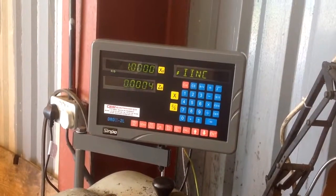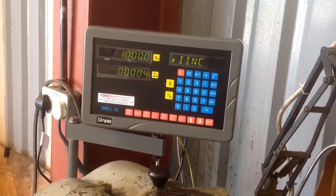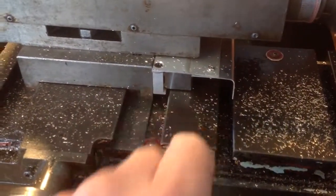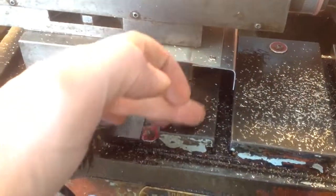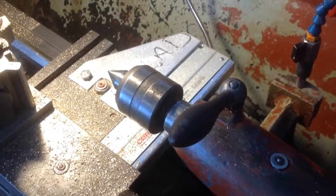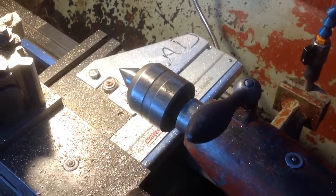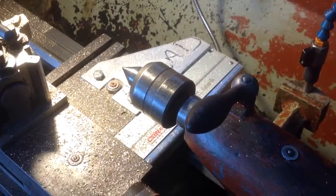I'm just going to have to get used to not staring at the DRO while I work and crushing the tool into things, and get used to its settings. But so far very encouraging. I've still got the other scale to attach, and I think I'm going to have to make a little chip sweeper to go under this guard here — I think small chips, especially brass, are going to get on the end there. A little rubber wiper to attach so they get swept out each time the scale travels. Apart from that, I'm very pleased with the general accuracy of this little tool and the cost. I've been wary of Chinese imports for a while, but times change.